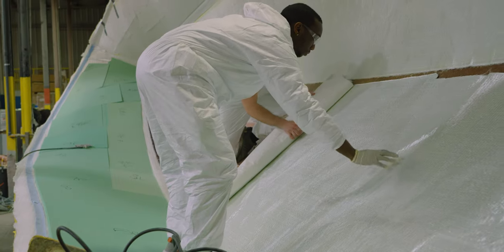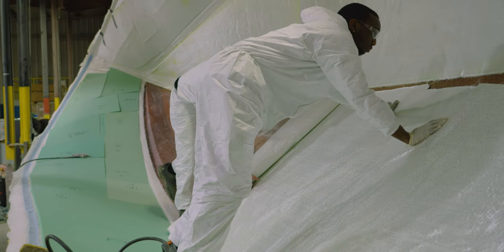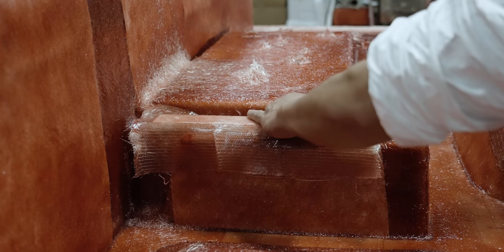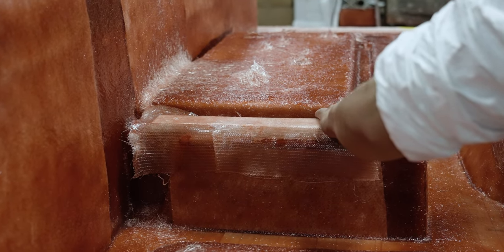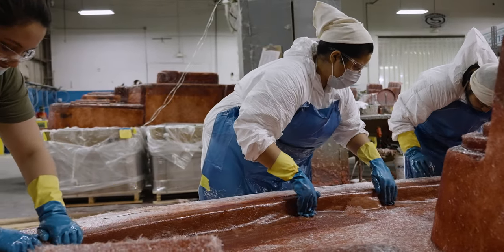On large, flat areas of a boat, such as a hull side, hand-laid fiberglass is fairly easy to work with. The problem starts when building more complex parts, such as decks. The tight radii cause the large sheets of glass to not follow the contours perfectly.